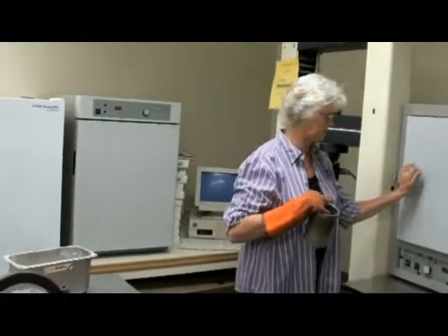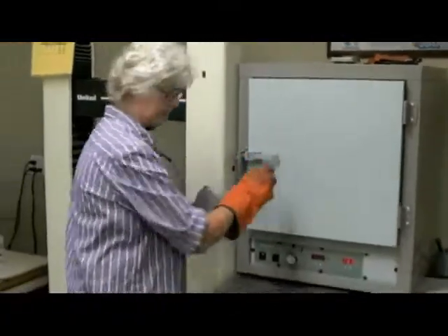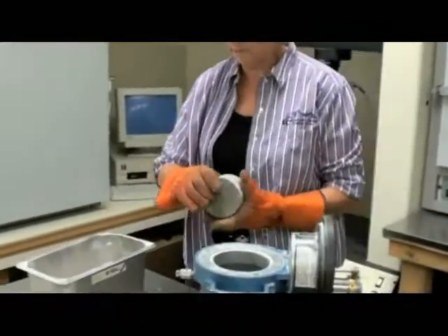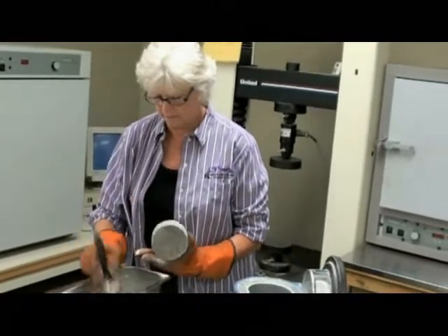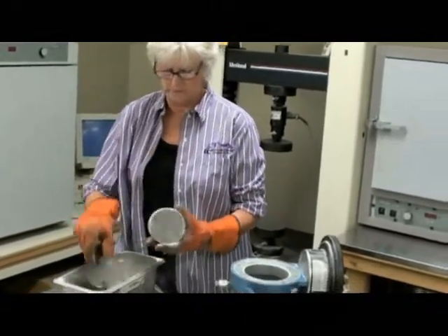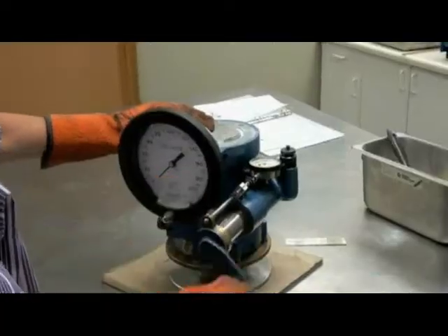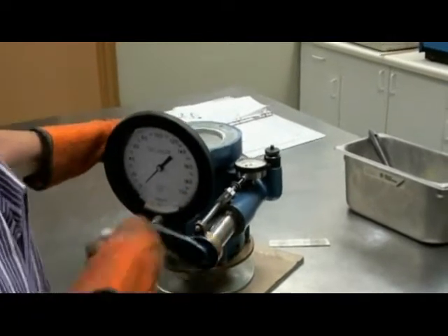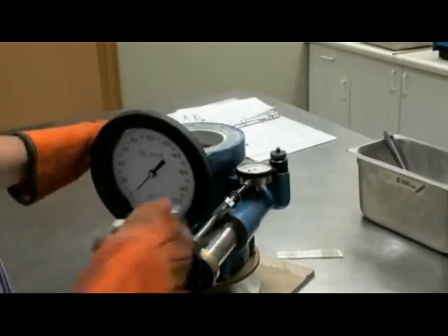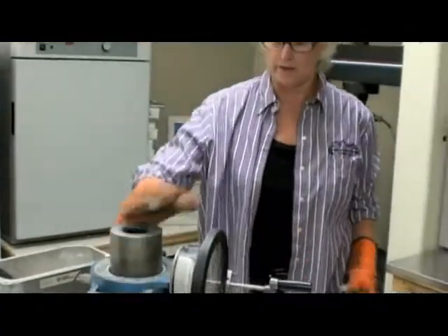Take the calibration cylinder out, then remove a specimen from the 140°F oven. Place powder around the outside of your specimen, or you can put powder on the inside of the stabilometer on the bladder. Allow it to slide down into the stabilometer. If it doesn't slide down, turn the handle out until it easily slides down. Make sure it's in there firmly, and place a follower above it.